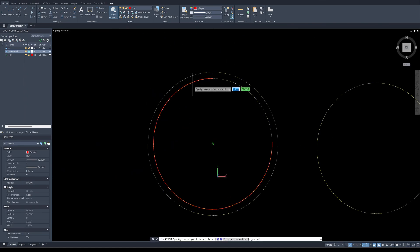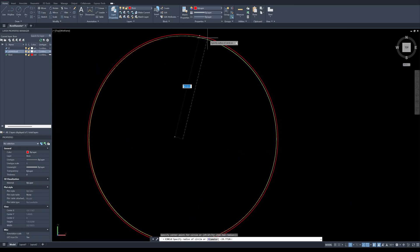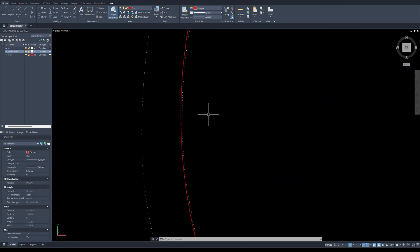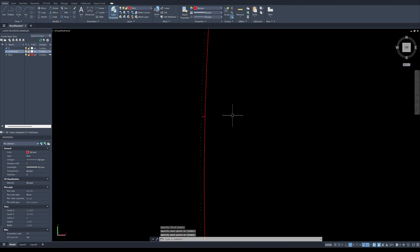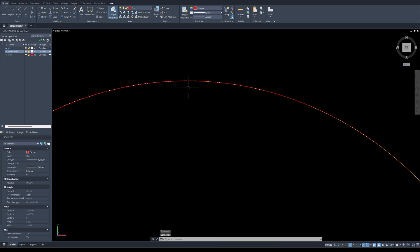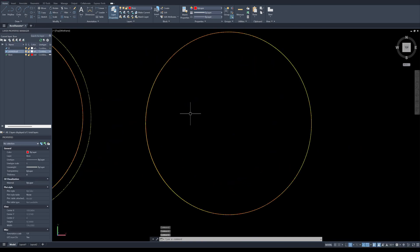Next I'm going to draw a circle. The red line is the perfect circle. The one from the single line is 100 microns out of roundness — about half of the cylinder. The one from the parallel lines is a lot less, only 50 microns out of roundness. The parallel line gave a higher precision than the single line because the marker was very close to the hole being scanned.